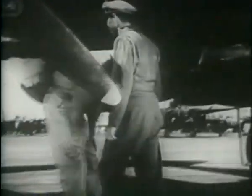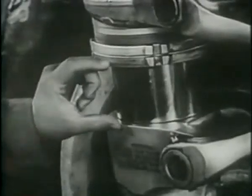Repeat the same inspection on the other two wheels. No cuts or bruises. Treads okay. No slippage. Strut clean and extended around 4 inches. And the emergency pressure? 750 pounds per square inch for the main landing gear.